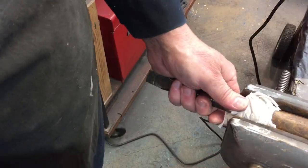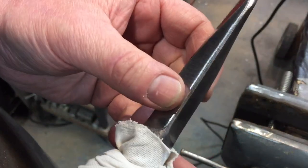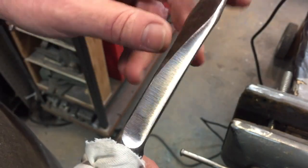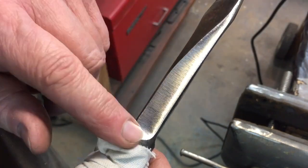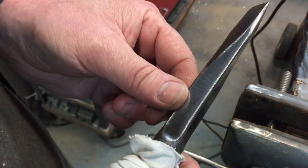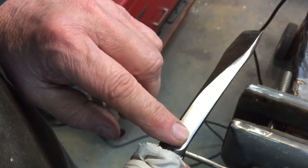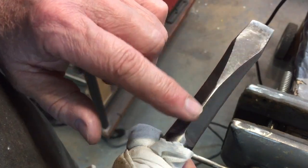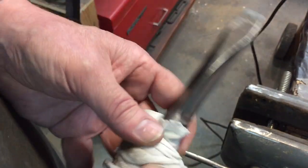Let's take a look at what it looks like now. Here's one we didn't do — you can see the side here — and this is the one we did. See how for the most part it's very flat all the way down. And remember this curve here, we just touched it and dragged it. This is just the initial grind. We're going to touch it up, but do you see how nice that looks with just that flap sander? That's why I like it better than the belt sander for these. Afterwards you'll just touch the flat to get that sharp edge back.